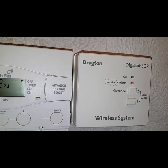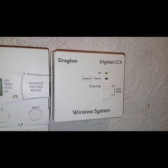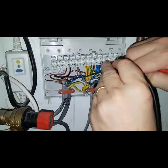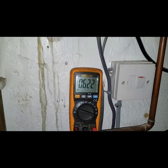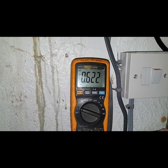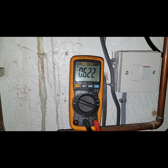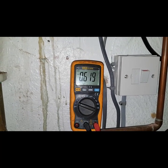So we're going to have a look at this cylinder stat and see what's going on upstairs. Interestingly, it just clicked — you can see the on light is now on. That came on seconds after I said it was off. So we're retesting it. Now the green light's come on but we're not getting the power here. Because the green light's come on, it's actually working backwards for some reason — when it was off it was on. So we're going to the cylinder stat to see what's going on there.